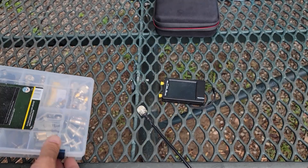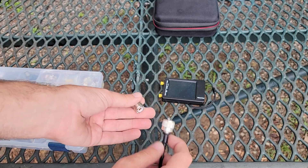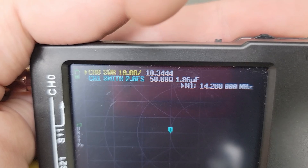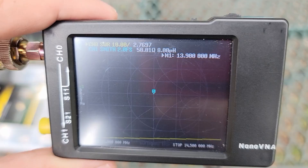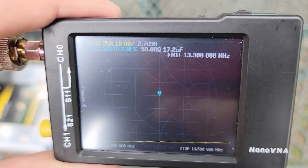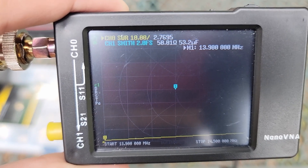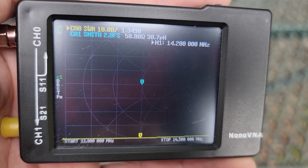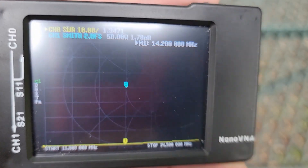I'm going to need some coax adapters to get me from PL-259 to SO-239 to SMA male to plug into the Nano VNA. I'm going to get this thing all calibrated. Right off the bat, we have a 10-to-1 SWR as you can see at the top of the Nano VNA. I'm going to adjust the whip. We are now all the way extended on the whip — we're resonant at the bottom end of the band, which means we're actually too long. I shrunk it down six inches and need to keep shrinking. After a little bit of adjustment, I've got it at 14,200 and 1.3-to-1 SWR. That's good enough — that is how you tune it.